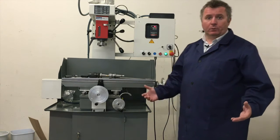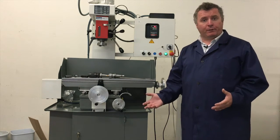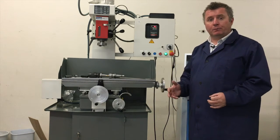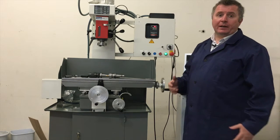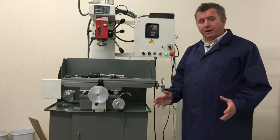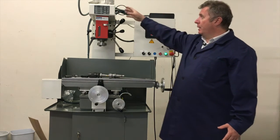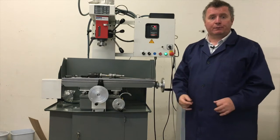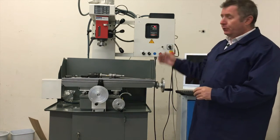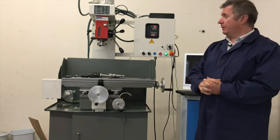So how does this work? The frequency drive is connected by 230 volts, or any other configuration which is necessary, and converts the energy to the motor. It's a very effective device. This motor has 2.3 kilowatts and has a gearbox here. The gearbox can under- or over-drive.